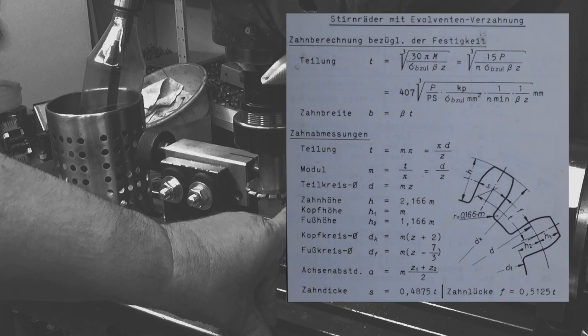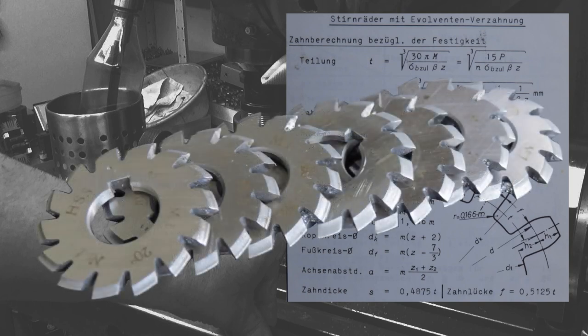By using involute gear cutters, one does not need to worry about all the complex mathematics behind these gears. All you need to know is the major diameter and the cutting depth. Of course, one should choose the correct cutter for the gear under work. The cutters come in sets of 8, each dedicated for a specific range of number of teeth. Since we are making 16 teeth gear, we choose the cutter number 2. The numbering of the cutters may vary depending on the manufacturer, so it is better to check the documentation at this point.